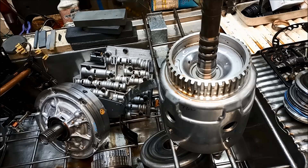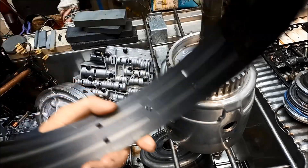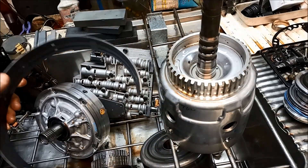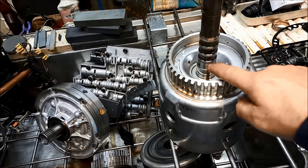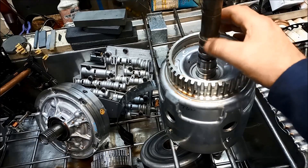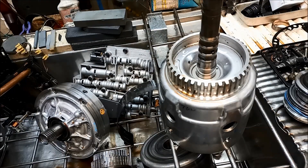Anyway, I hope that information has helped. You can also see a little bit of metal has fallen in between the band and the drum. So to summarise: the rear planetary failed from that lube seal, and the 3-4 clutches failed because of the collapsed sealing rings. The bushings are all worn out as well — not much you can do about that at that point.